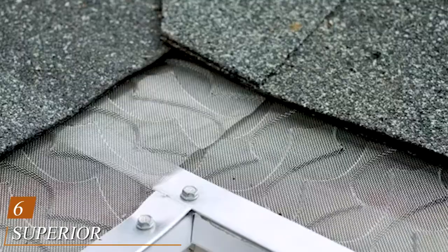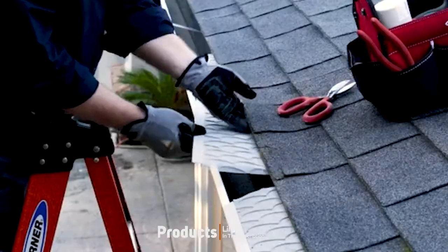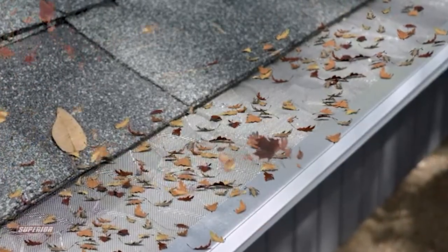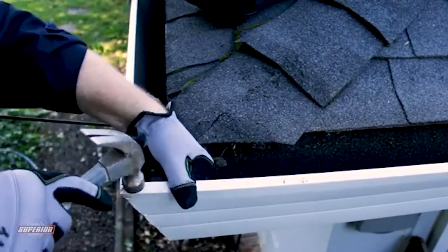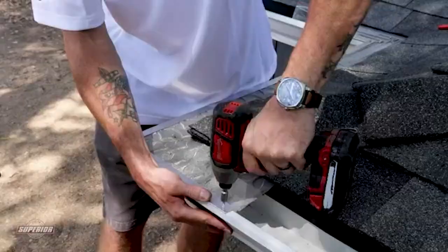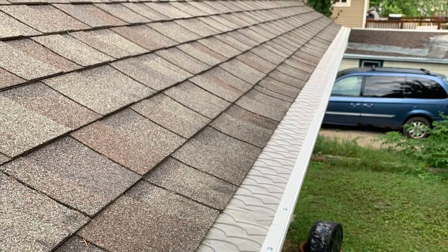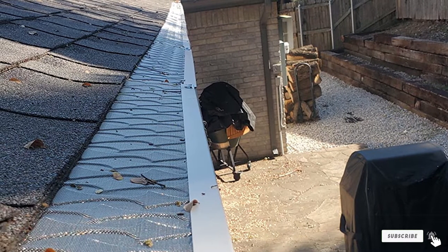The number six position is dominated by Superior Gutter Guards. Prevent the buildup of leaves, sticks, mud, and dirt with this micro mesh gutter guard made of durable stainless steel. The solid metal frame slides under the first row of shingles, and the other side of the guard sits on the outside edge of the gutter. Secure the gutter guard to the roof and to the gutter to ensure that the drainage system is protected in any type of weather all year round. This micro mesh gutter guard system totals 48 feet in length and is made for standard 5 inch gutter systems. The mesh has a raised pattern that slows flowing water, allowing it to drain into the gutter below while debris slides off the top. The guard should be installed at the same sloping angle as the roof to help debris slide or blow off.